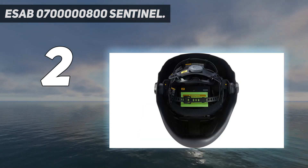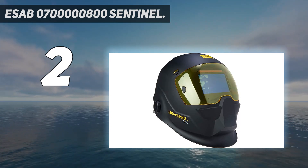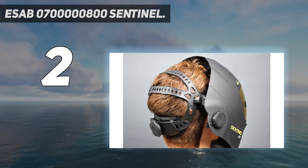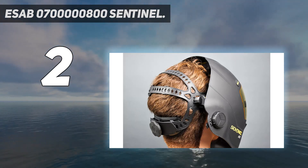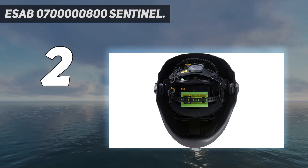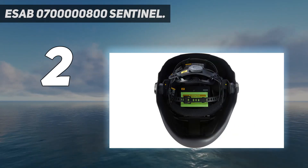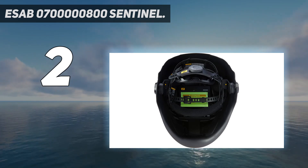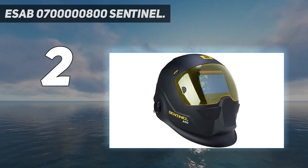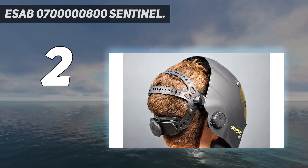The Sentinel A50 matches the comfort level of high-end welding helmets from Miller and Optrel. But the Sentinel A50 is not well-suited for people with large heads. Size can be subjective, but consider an Optrel helmet if you've had issues finding a hood large enough to fit your head. The spherical lens gives the Sentinel its characteristic euro-cool factor, but the lens is also responsible for increased light transmission and the helmet's durability. Sparks easily slide off the spherical lens. However, these lenses are a double-edged sword — the internal glare is more pronounced, and replacement lenses are more expensive than standard rectangular lenses.